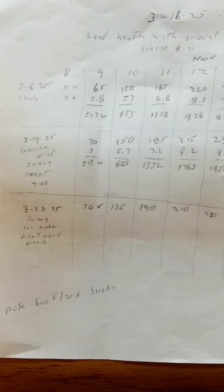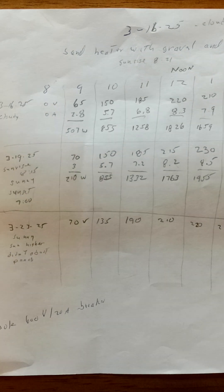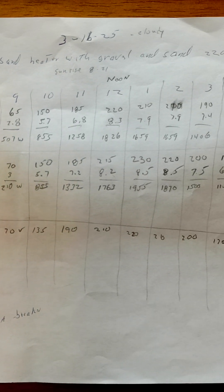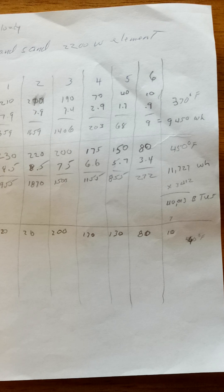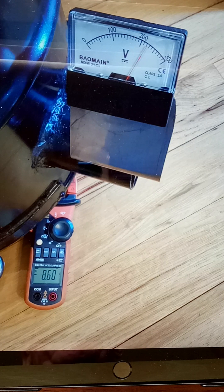Here's a worksheet of a couple of days of recording the voltages and amperages and multiplying voltage times amps to get the wattage. Even on a fairly cloudy day I got 9,450 watt-hours. On a real sunny day I came up with 11,727 watt-hours. It normally likes to run around 220 volts when the sun is straight up and it gets 8.6 amps, maybe 7 amps out of it.